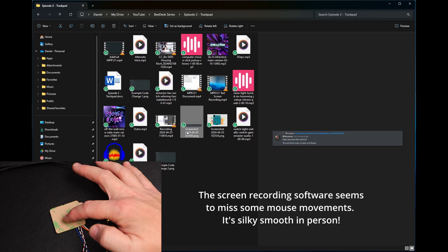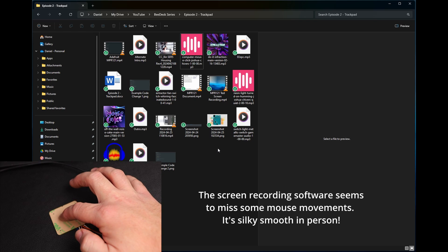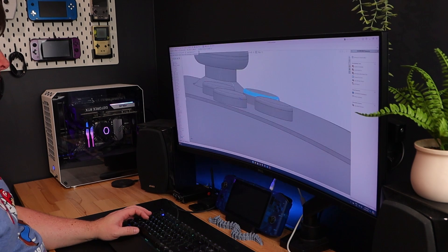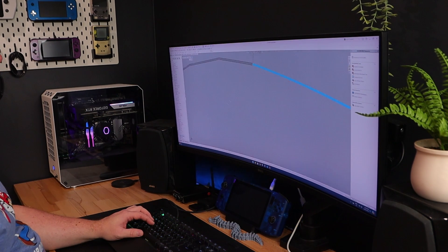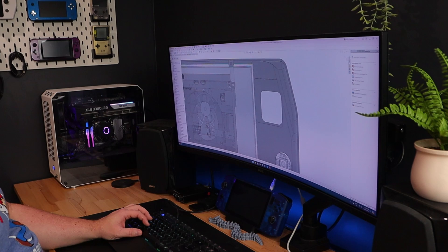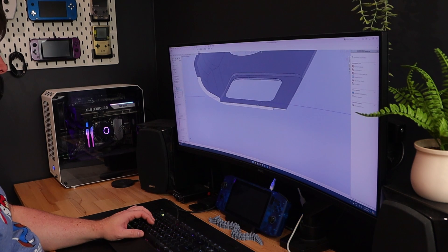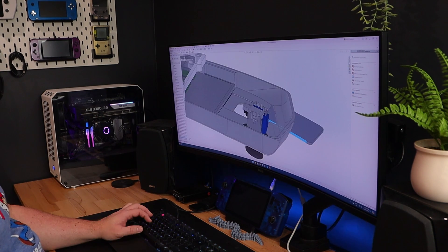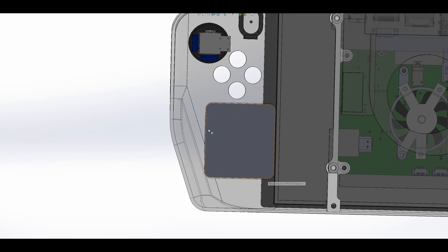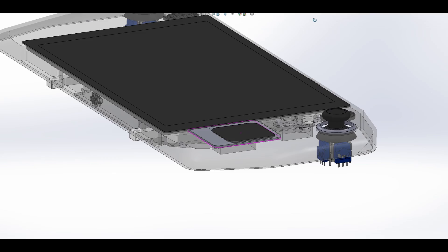The motion feels fantastic, the gestures work really well, and it does a reasonable job of palm rejection too. It's a shame it's a bit too big for the controller, because for only seven Australian dollars this thing is otherwise perfect. I drew it up in CAD anyway and realized I can hide part of the trackpad below the screen bezel, which might give me just enough room to squeeze it in without removing the chamfered bottom edge. I ended up stretching the housing width by about three millimeters and pushing the sticks closer to the outside edge to move the buttons up and make room for the trackpad — only on the right-hand side as one trackpad is enough. Let's fire up the printer and do one more test print to make sure everything feels natural in the new positions.